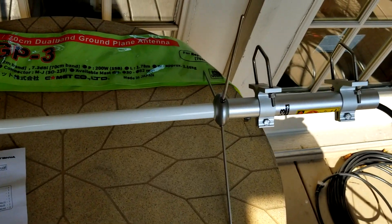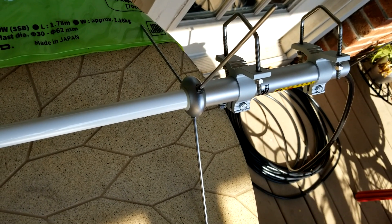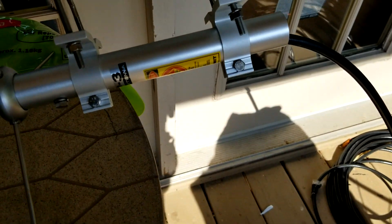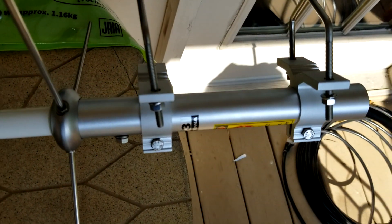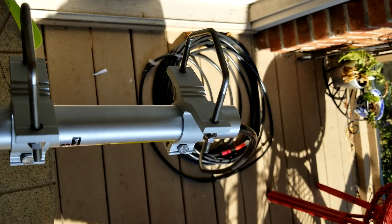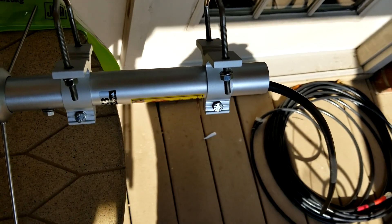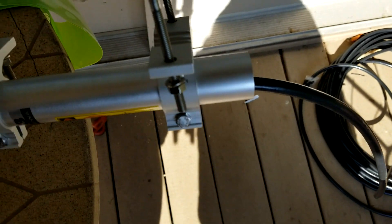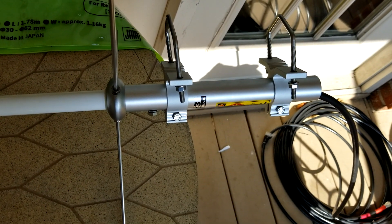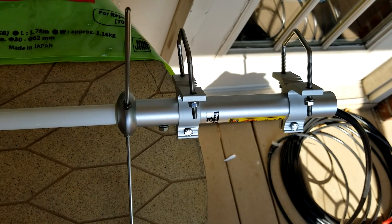I'm back. If we take a quick close-up here, you can see where the radials just screw right in. There is a nut used to fasten it and lock it in place. Then you have these aluminum clamps that go around the aluminum part, which also affixes to the antenna. And then there are U-clamps and bolts that are ultimately going to connect to the mast. You can also go ahead and feed your cable — I've already got mine fed into the tube. There's nothing on the top half of the antenna. All you have to do is read the instructions, put it together, orient those two clamps and brackets, and you're good to go. Now it's time to put it on the actual mast.